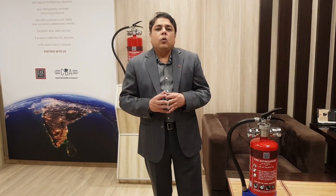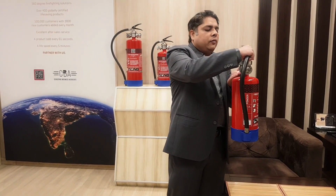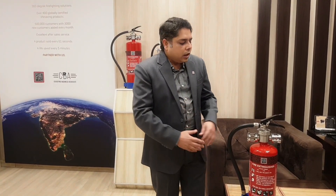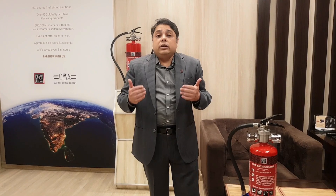Another method is the suppression mode. If you have a room that needs protection and does not have a lot of footfall, you can install this equipment onto a wall at 1.5 meter height. The equipment will automatically suppress the fire. The content of the extinguisher spreads around in a semicircle, giving total suppression and preventing the fire from proceeding forward — greatly helping to stop the spread from one compartment to another.